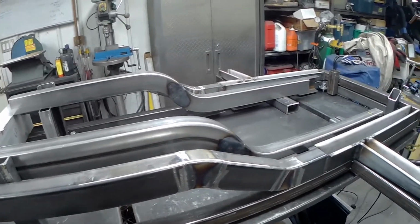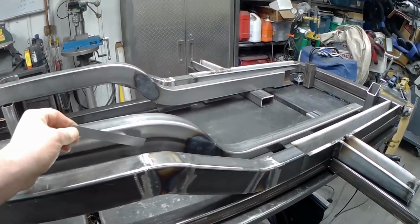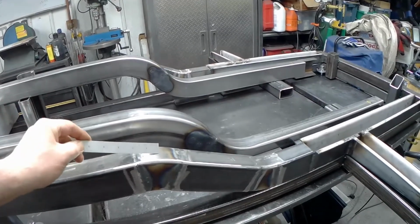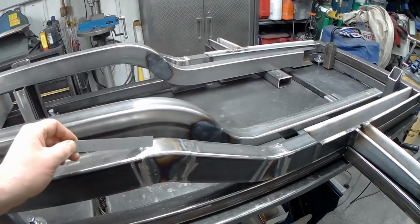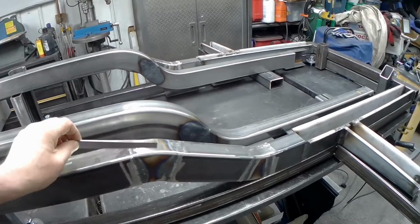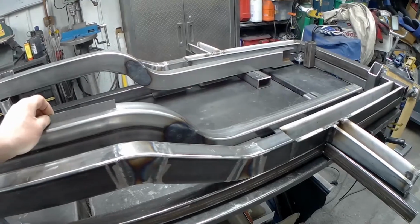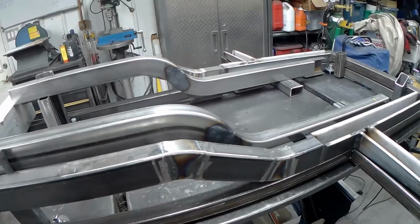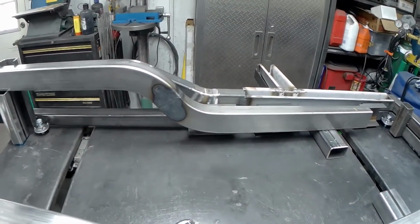So as you can see, not only do we gain this little bit of height here, but also the way that the bend was able to be made. These were bends that I bought from the folks at Welders Series, and their style of bend is where you assemble them out of parts and then you weld them together and then you can cut them apart, but their bend radius is fixed. Well, the folks at Art Morrison were able to give me quite a bit tighter bend radius, which actually is going to help. In fact, it's a bit more clear on this other rail.